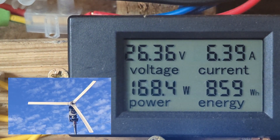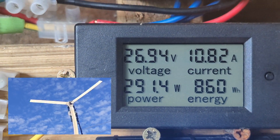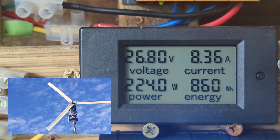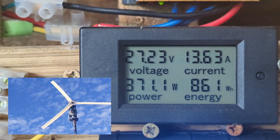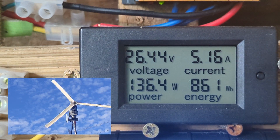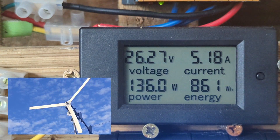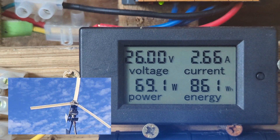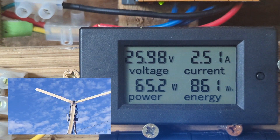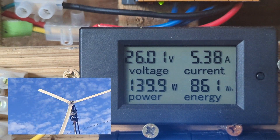The dump load is still drawing 210 watts. That's some really good power — 10 amps, sustained 10 amps. That's what we want to see. Dump load is still going at 212 watts. Let's get that beast a-glowing. Interesting to see the turbine kind of working better with the 200 watt load applied.